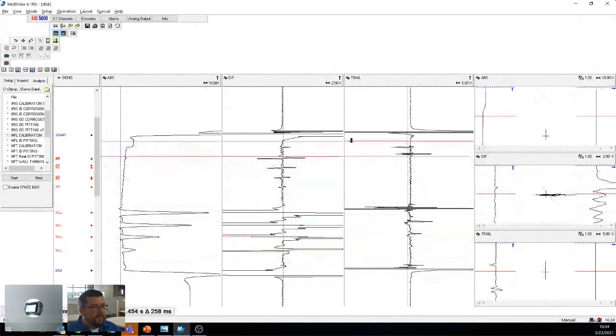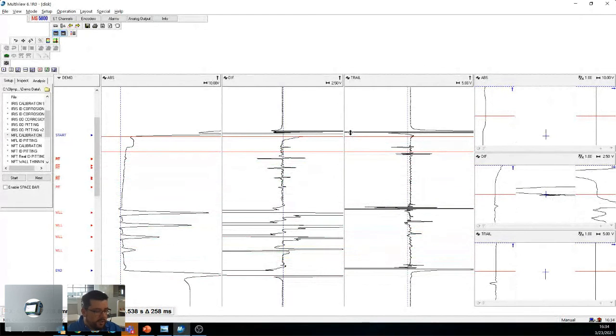So this is MFL. This is, like I said, if you can assure that the wall is saturated, with fin fans, it does a pretty good job. Really popular around anywhere where they have a lot of salt water. Really popular.